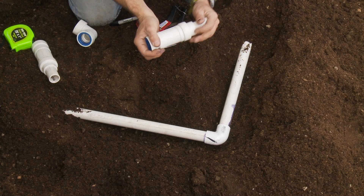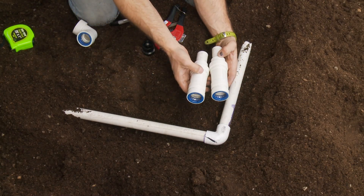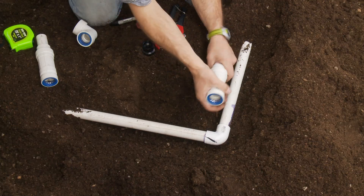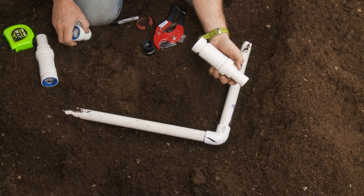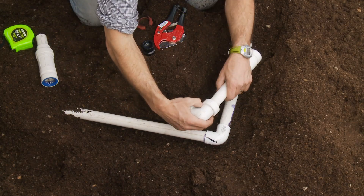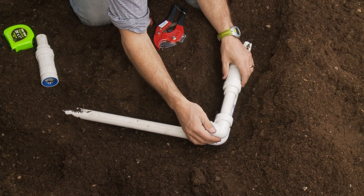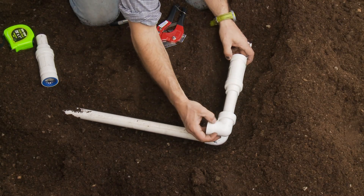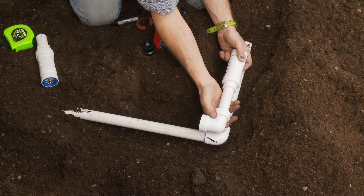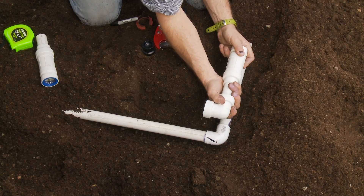So what we're going to do today is use two PVC lock slide repair fittings, both equipped with, on one end, the PVC lock fitting, and then on the other side, on one of them, we're going to install a 1-inch elbow like this. To install these fittings, you push them and rotate them to the right about 90 degrees. And because they telescope, it'll give us the flexibility we need to repair this fitting and make it a solid set fitting.